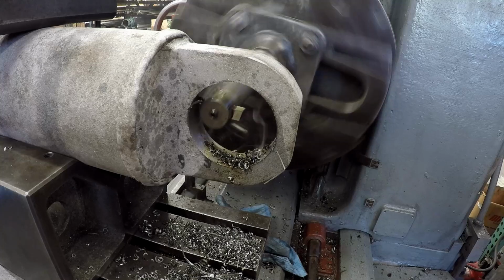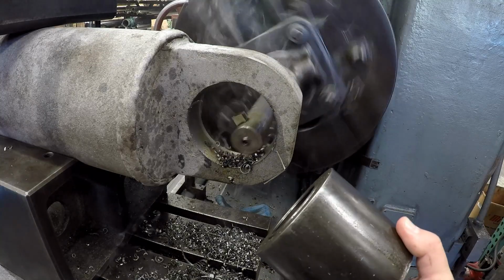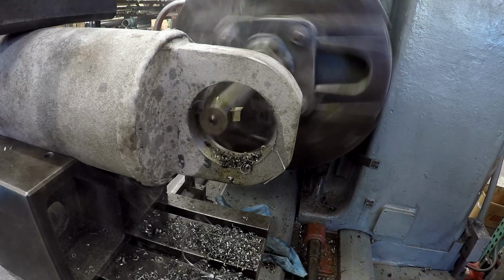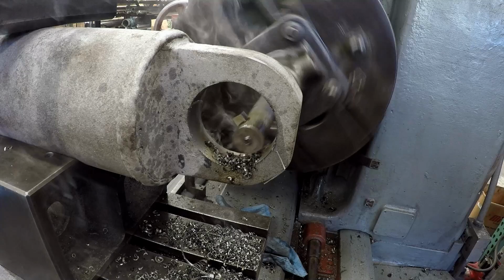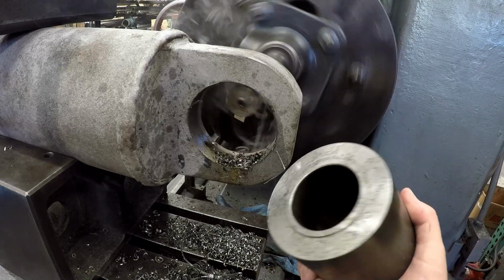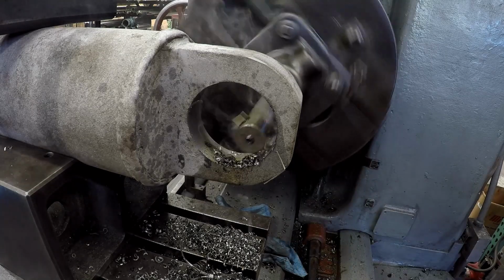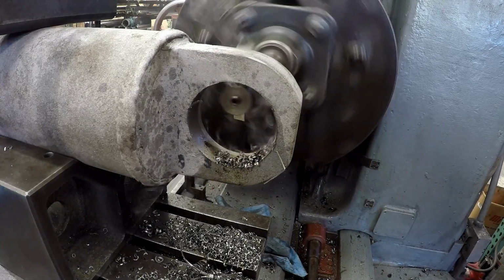And I wanted to show you, this is actually the tubing that I'm going to use right here. That other piece that I just showed you, I forgot was cast iron, so I need to mark it on there what it is. But after I turned the video off, I realized that's not steel, that's cast. This is DOM tubing right here, heavy wall stuff. We'll make a sleeve out of that and get it welded in there.